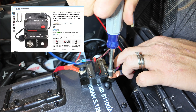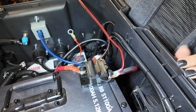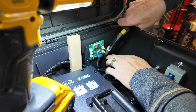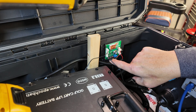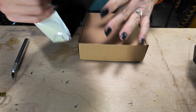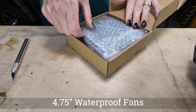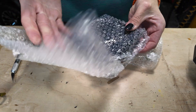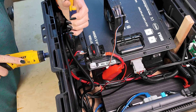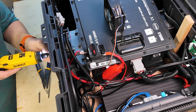I did install a breaker on the top of the battery that will shut off in case of a power issue. I'm also going to install the temperature regulator — a little control board I bought off Amazon, super cheap, and this is what I plugged the fans into. After hearing how loud they were, I ordered those replacement four-wire fans. It took a couple of weeks to come off the boat from China, but these are the perfect fans and they fit in the exact same place. I'm going to install them on each side so that when I set the temperature, it regulates fan speed — blowing really slow at first, then speeding up the hotter it gets inside the box.